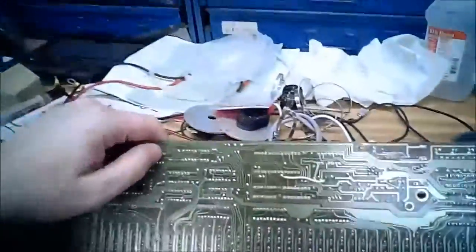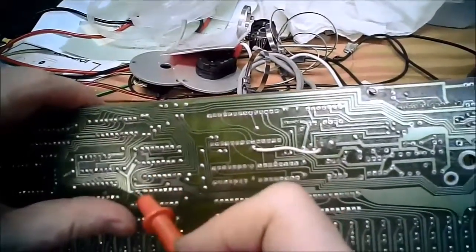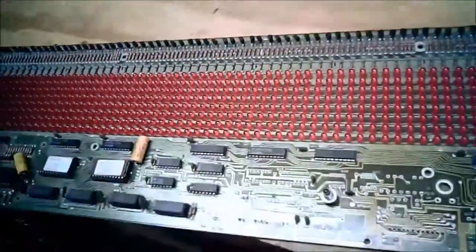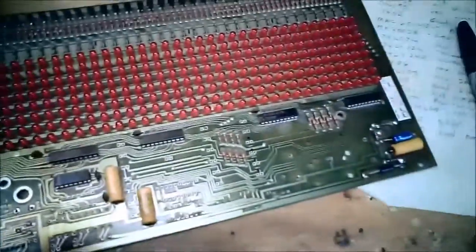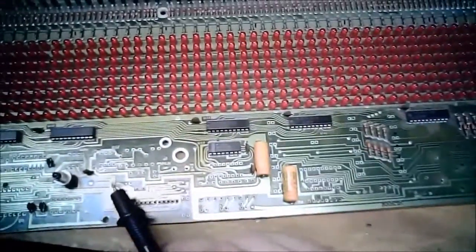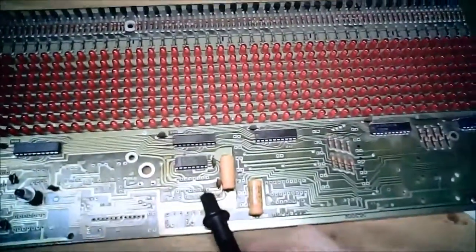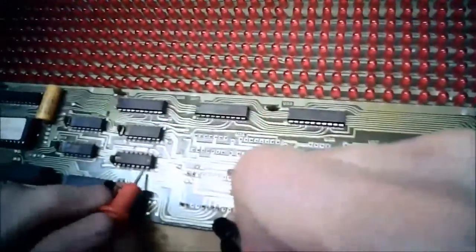This pin right here, which is 1, 2, 3 over. Why do I have him marked off? Oh, because he goes there. Ah, he was the pain in the keister pin. That's right, he came from somewheres over here. He might have been the pen input pin. No, he came off. Yep. So the pen input here went to the last JK flip-flop, or SR flip-flop, and then came back into this guy. So that's why he's marked off. So here's the output, here's another input.